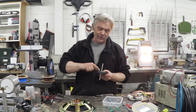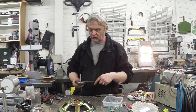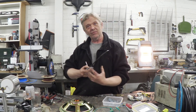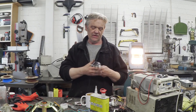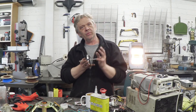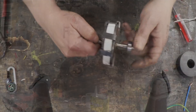Now, what we need to do is put some L-brackets on here, coming down there, and we need 8 of them. The L-brackets I'm going to make out of this bit of 1cm steel, and they'll go on like that and bend over to cover that bit of the magnet. There'll only be 4 a side, and that will give us 8 poles. So all I've done to those magnet plates is weld on those little angle stubs. You can screw them on, I just like welding things. So weld on those angle stubs, and I've put the magnet back in. Now, these ones point this way, and these ones go on pointing the other way. And what we've done is twist the field around. So now we have north, south, north, south. And there's the rotor finished.